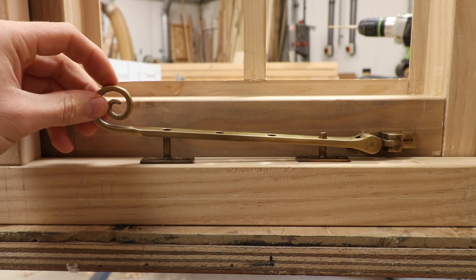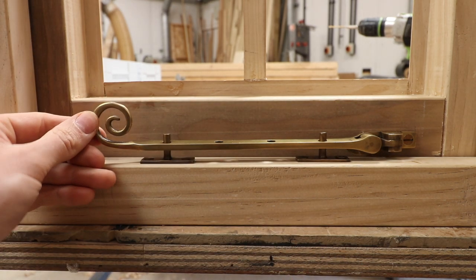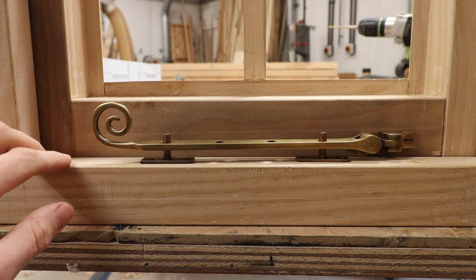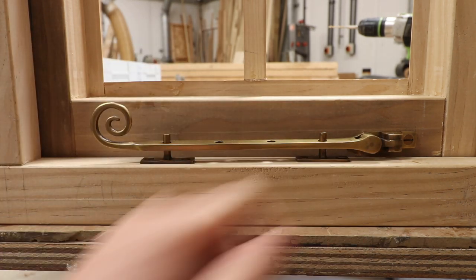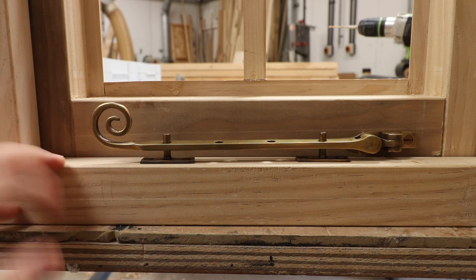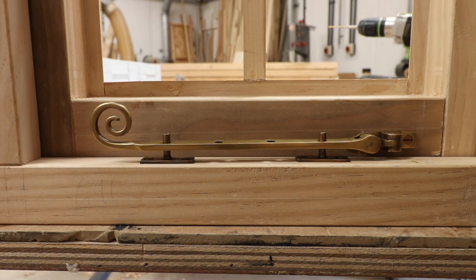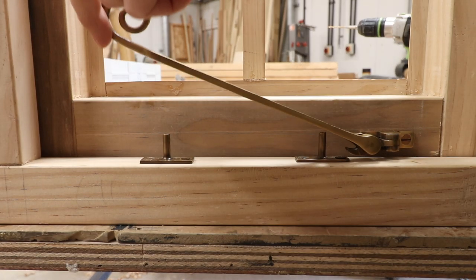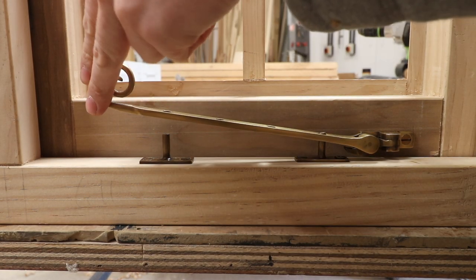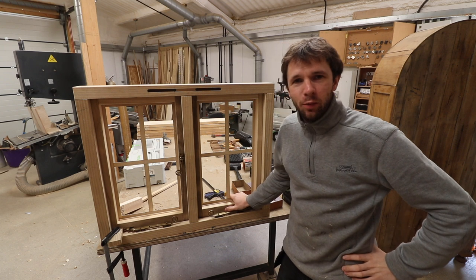When done it should look like this from the side — nicely off the surface but holding itself level, using pressure from the pins. It's also acting to pull the casement against the draft strip with a tiny bit of pressure once the seal is in the exact compressed state you want. We use the casement stay to pull it in, the first pin pulls the casement against the seal applying pressure to hold it, and then the casement fastener does the final fastening of the window.